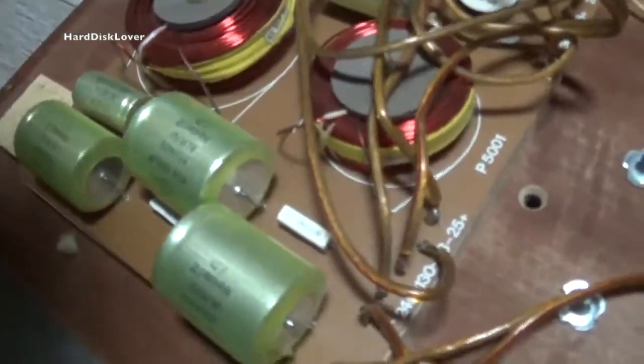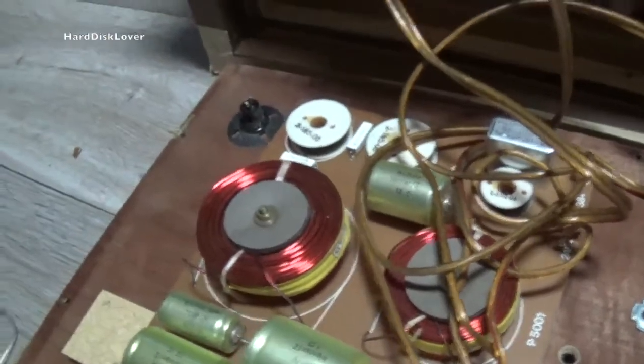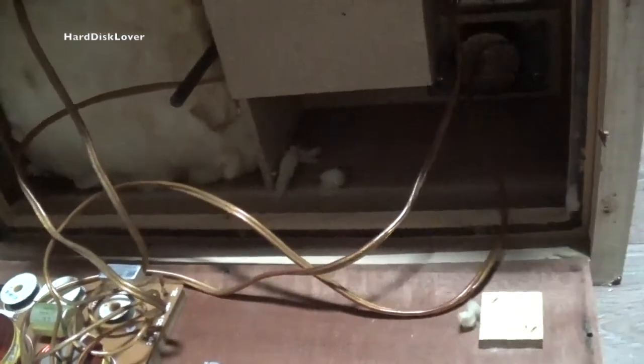Yeah. So, well, let's just have a look inside here and see if there is a cable break or something. Or it could be just something wrong with the board. Bad solder joint. Or a short somewhere. I'll go and have a look at both. I mean, none of those three speakers seem to be working, so, yeah. Gonna hook a VU meter up to each channel and see what happens. Or, another thought is that the guy got the polarity wrong. But it doesn't really seem like that.